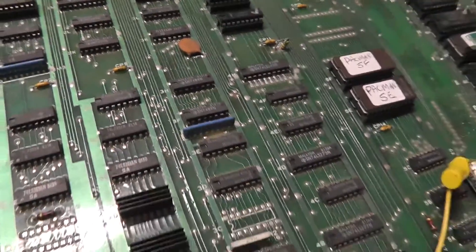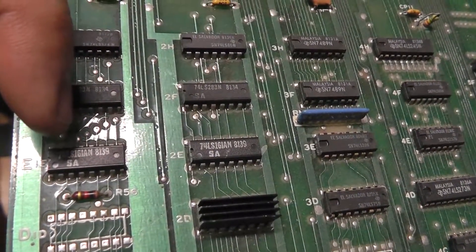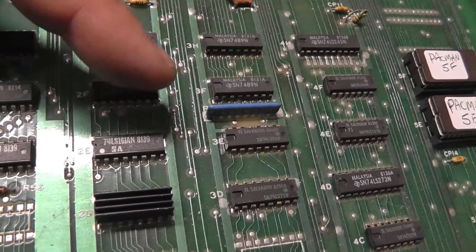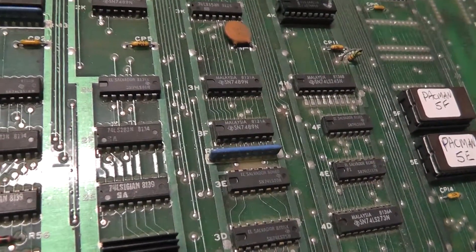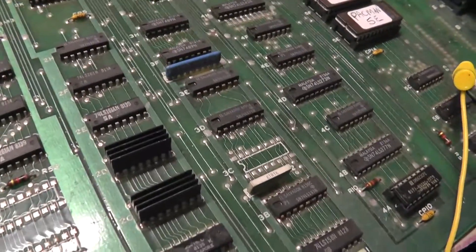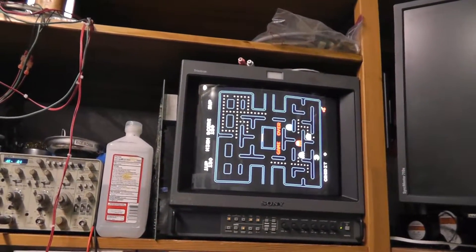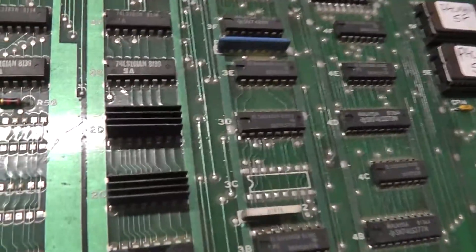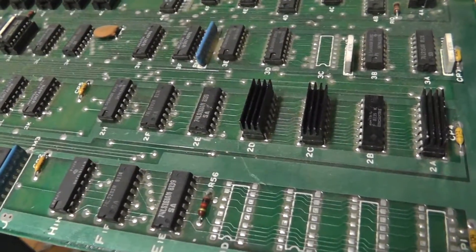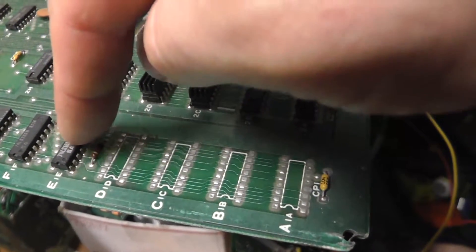It's RA0 through 7 — specifically 1E pin 14, 13, 12, and 11, and the same thing with 2E pin 14 and 13. Those are the read address lines, RA0 through 7. When I was grounding those, that's when it all of a sudden started working, so I have no idea why. I was using my oscilloscope to check these counters and just make sure none of the inputs or outputs were stuck high.